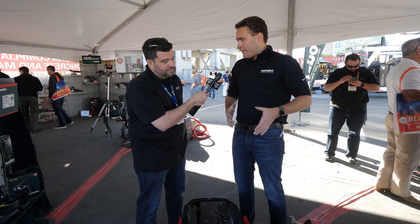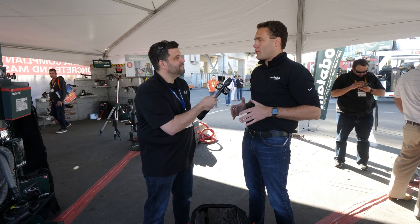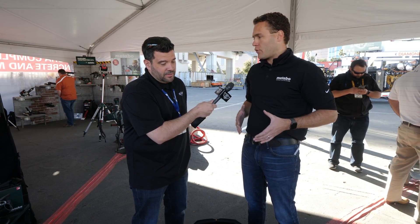We have the best airflow — you guys have measured it at 130 CFM. What we're really excited about is that in April, we'll have an upgrade of the motor on this vacuum with a much more efficient motor that will pull 157 CFM. So now you can access six-inch tuck pointing, six-inch grinding, and be table one compliant with the OSHA system.